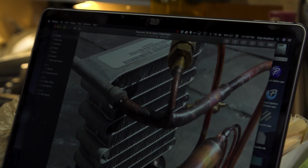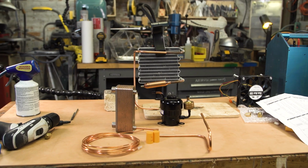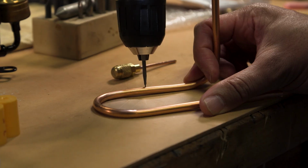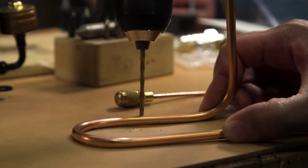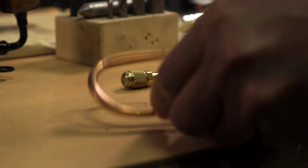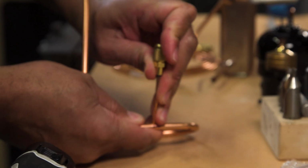I did this way closer to the copper. Yeah. So we're not going to do it that close to the copper, because I think I probably got lucky there. Just a little bit of an angle. There's no reason to expect accuracy from drilled holes on a mill. So having center drilled that, we have a really clean hole now. That's lovely. Get a nice fit there.